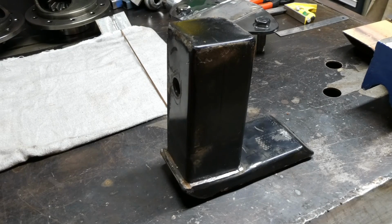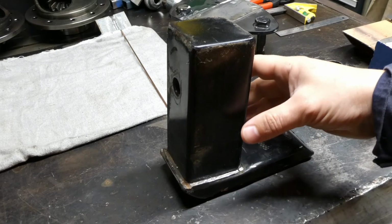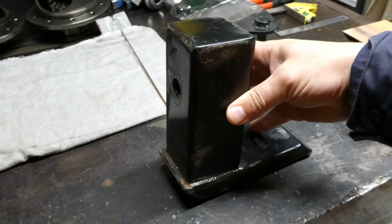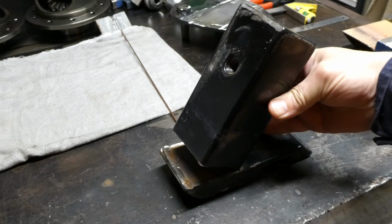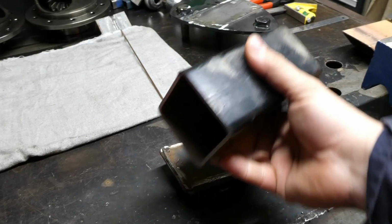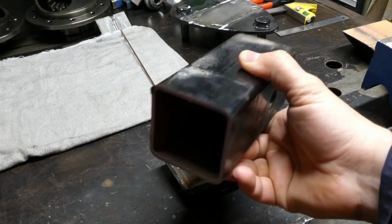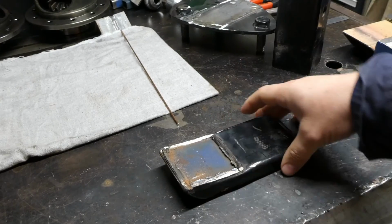Okey dokey, so we're back at the bench. We've got our assembly here, so getting it apart was not too difficult, not a huge drama, but still a bit of a pain. This required just a thin cut-off wheel, cut through there, pull that off, and this component here was just squared up on the bandsaw. So that's all good to go. This whole thing's been powder coated as well, so that will be talked about later.